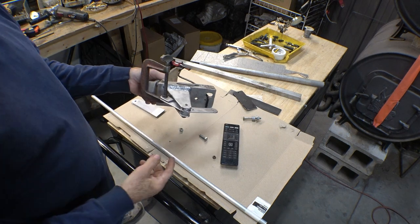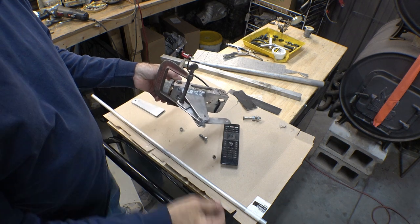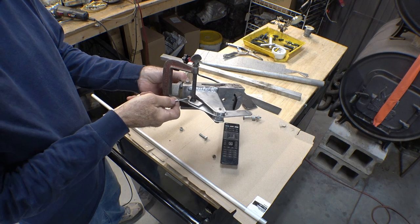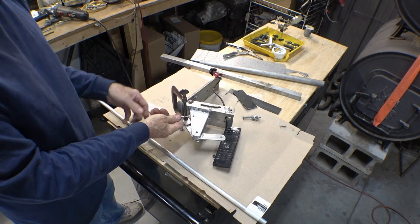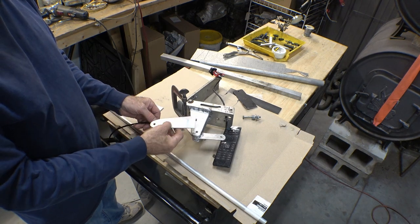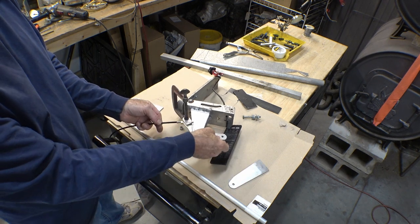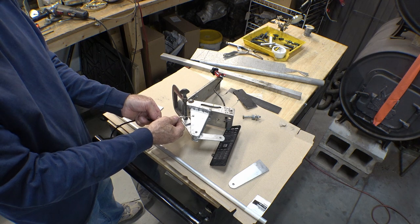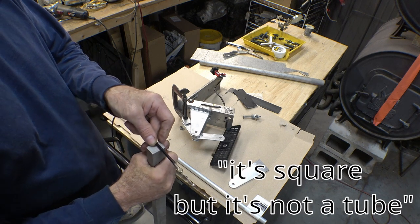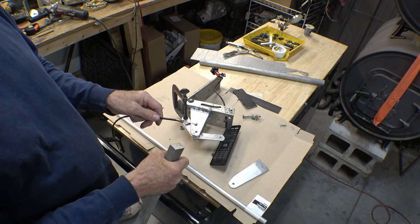Here's where we are. I've got a little spacer in there. I'm going to weld this on, and that's going to be turned into a hook for the cable end to lock down into. I also have to have a way to hold the cable down here. I've decided on two arms coming back like this and clamping onto the cable, so that as this swings through its arc the cable can follow it a bit and doesn't come over a hard edge and fray. I'm going to take this little piece of square tube, drill a couple of holes in it, make a cut, and make a clamp out of that.